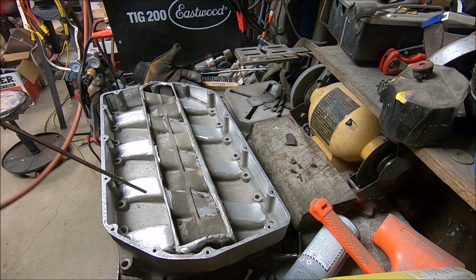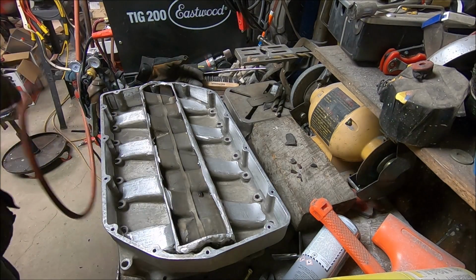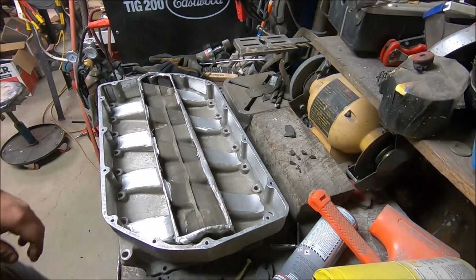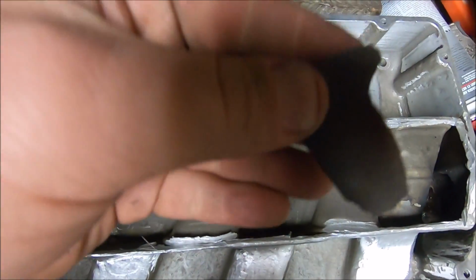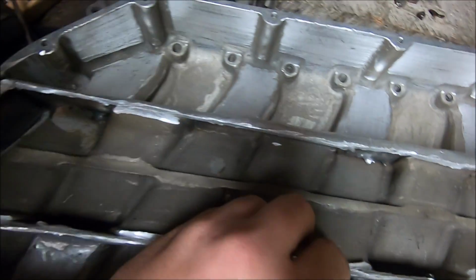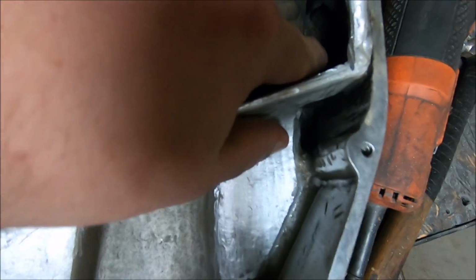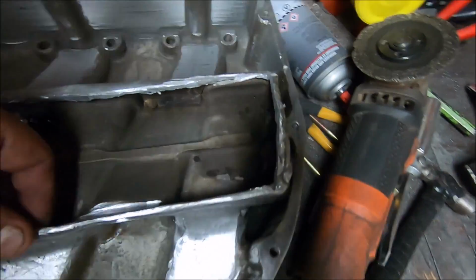Well, guys, that was loud to my ears. There it is, opened up. And I tell you what, big chunks of epoxy like that, covering there and there, are what was preventing our weld from ever sticking real good. We got epoxy down in there, we had epoxy here. We have a pile of epoxy down in there, which we have to weld. So, yeah.